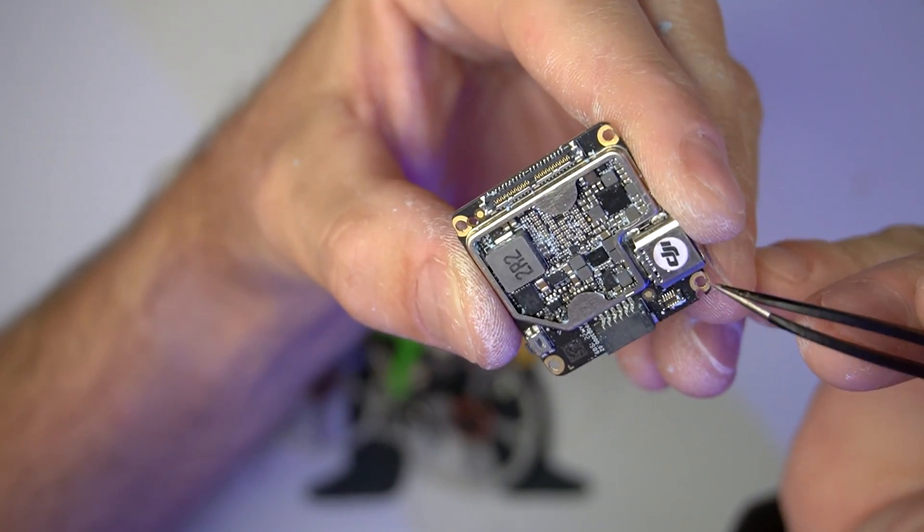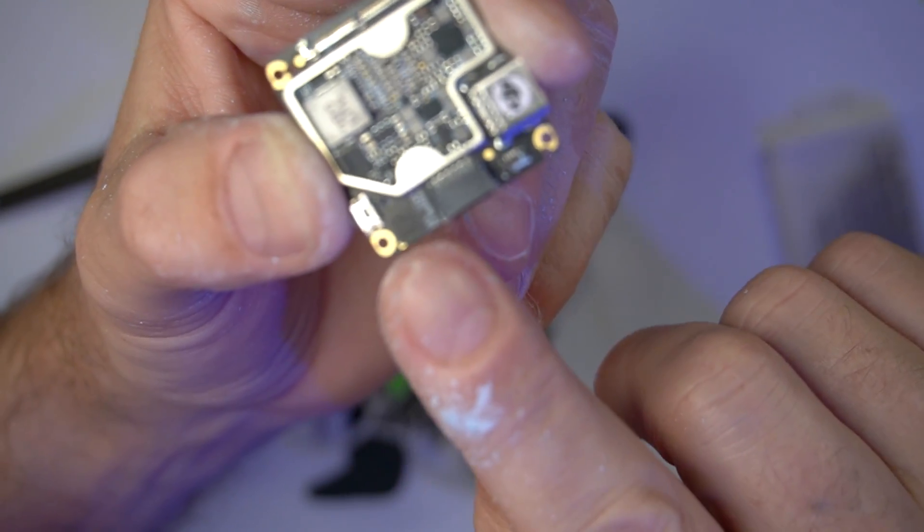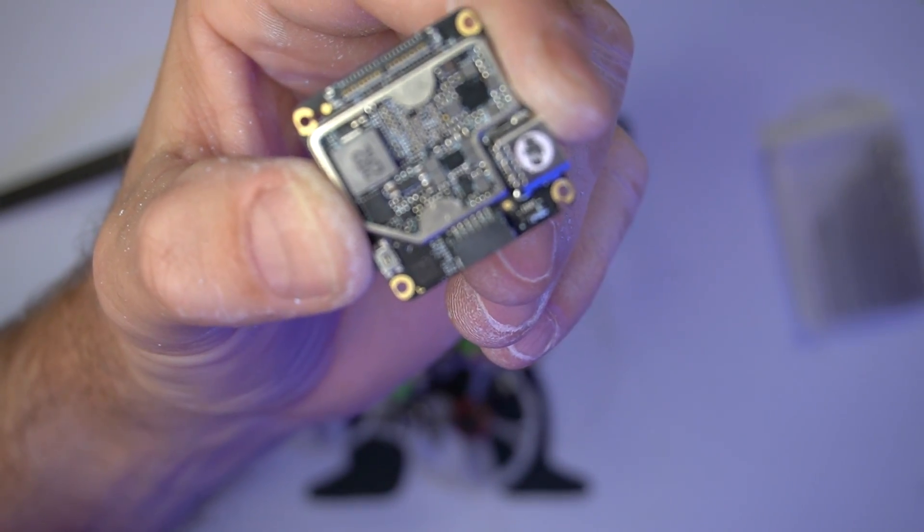Now the reverse engineering of the Mob Digital — a couple of things that are different. These holes are super delicate on both boards. They're not M2; they're like 1.6 or 1.9 or something. The problem is when you start to drill out these holes, there's a very good chance they're just going to snap off.